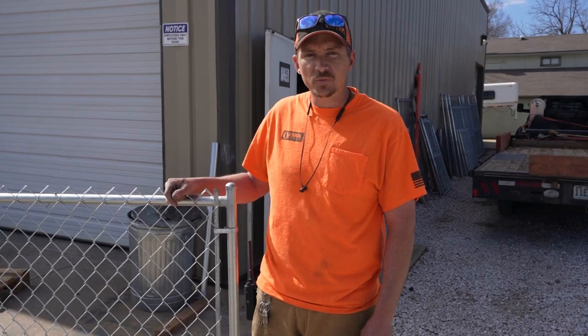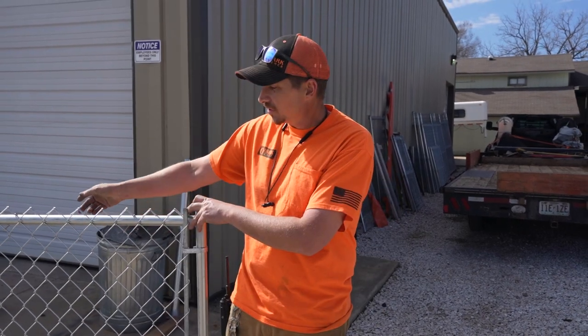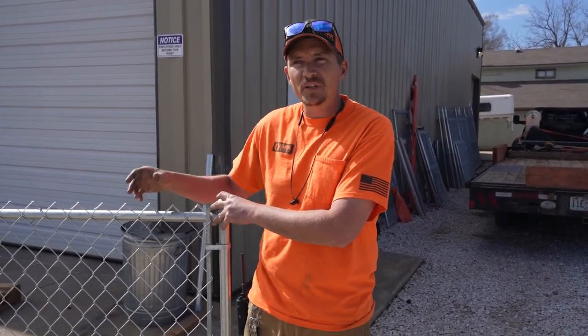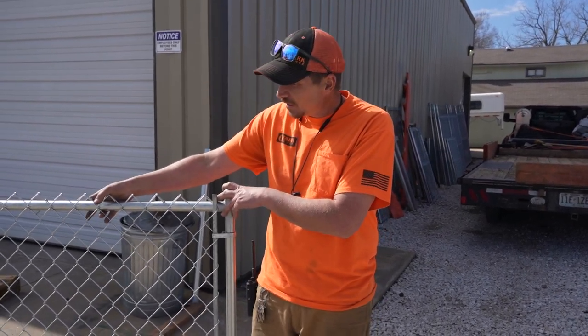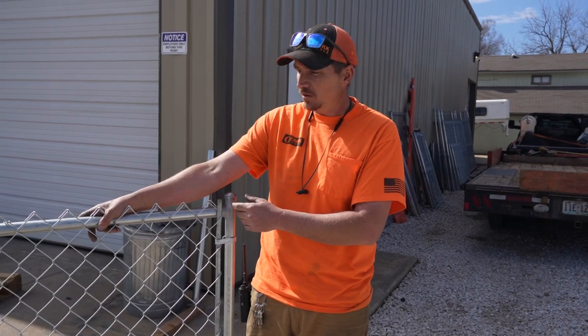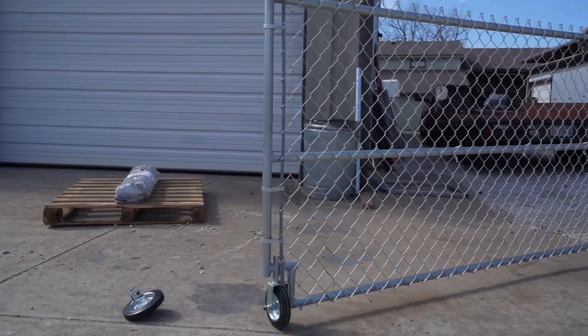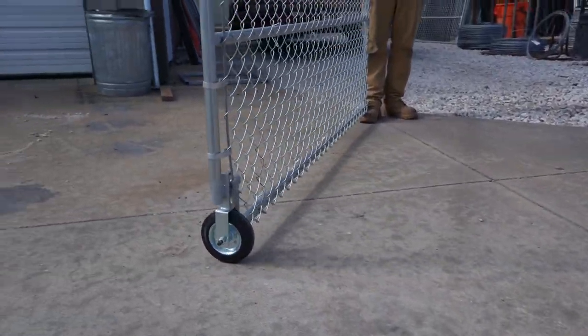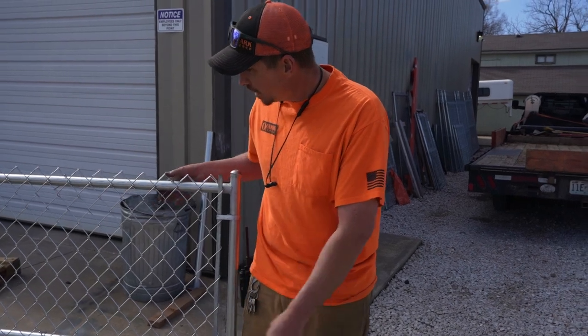We made this gate for Scott to go and install later this week. It's a double drive four-foot gate for a customer — it'll go over their driveway. We basically welded a couple of wheels that are meant to be bolted on to the bottom of a gate with a u-bolt, but instead we chopped up the corner of the gate to allow them to fit into the corner. Once it's attached to the post it should swing both directions fairly easily. It's got pretty good range of motion, so I think it'll make the customer happy and it'll be fairly easy to install — a win-win for everybody.